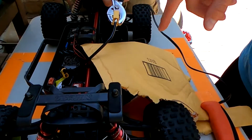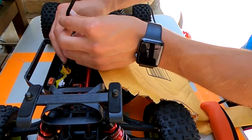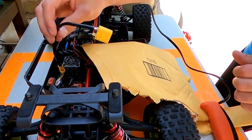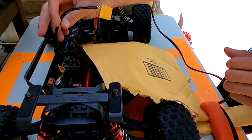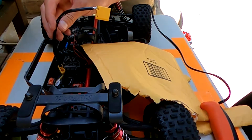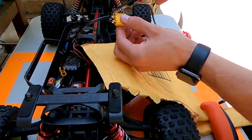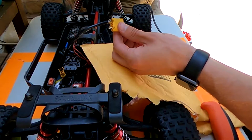We're going to let that cool before we move anything because it's very hot. Once you're done, before you pull up the heat shrink, let this cool a little bit — you don't want to pull up the heat shrink too soon because it will shrink before it even gets to where you want it. If there are a few stray wires sticking out, just take them off and knock them down. It's not the end of the world.